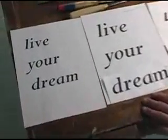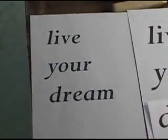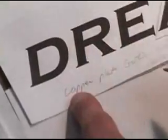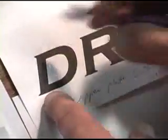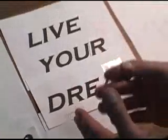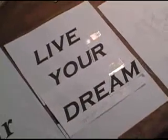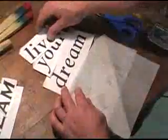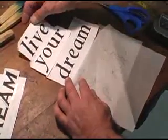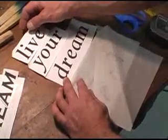I've gotten on the computer to find typefaces, something that's kind of a traditional letter, which has serifs on it, which are these little triangular bases. And these bold letters allow themselves to be skew cut or V cut, which is very traditional in sign carving. As far as signs go, I've always favored ovals as opposed to squares and rectangles.